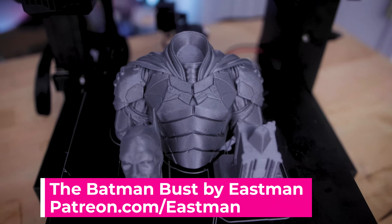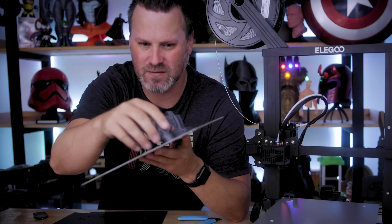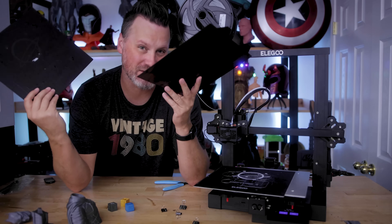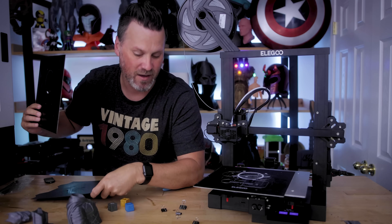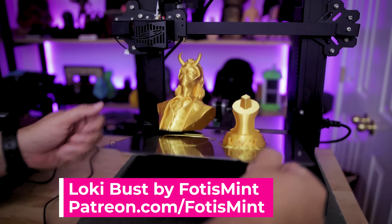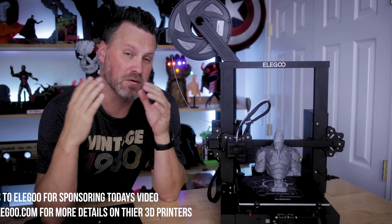Now here is a beautiful print from Elegoo off of the Neptune 2 with the standard build plate. Look at that crazy print adhesion — it prints so well, sticks perfectly, no issues with lifting. You just can't beat this original build plate surface. Unfortunately, this experiment was just a bit of a bust. I was hoping we'd find a way to repair build plates showing lots of wear and tear, but this is unfortunately not going to be the solution. For now, if you have a worn out build plate, I'd recommend continuing to use it, or upgrading to magnetic flexible build plate options, or a glass or mirror type surface that fits your build plate size.